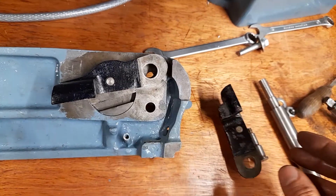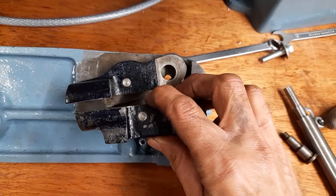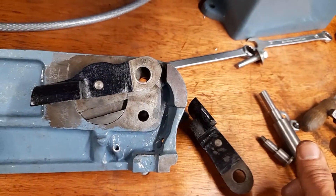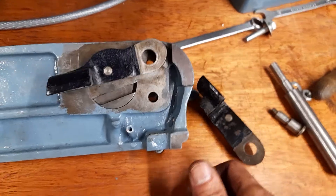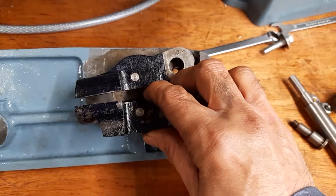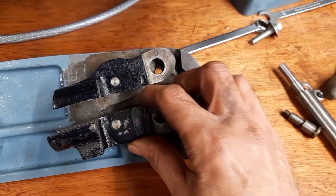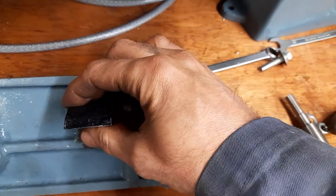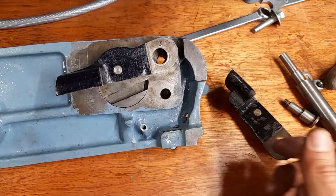Making two of them will give me pretty much full control over both the clasping together and also a little bit of forward and back movement. I've posted some photos online and people have had some doubts about whether the nuts are actually correctly in alignment, but having this eccentric might allow me to adjust that. Overall, this isn't an ideal solution — the ideal solution would be new nuts — because really what I'm going to end up doing is more or less just toeing them in a little bit. I did experiment by popping a couple of set screws through and locking them tight to check the principle, and it had a good enough purchase on the lead screw.